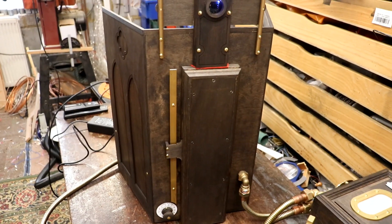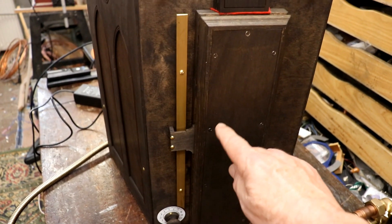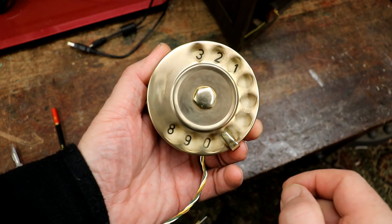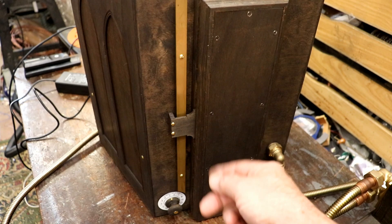But I need a way to tell the Teensy what time for her to say. I was thinking, well, interesting — because there's not much room — I'm going to have to have something on the back of her enclosure. I don't want something else to plug into all this, I want something simple. I was thinking you could have two potentiometers — like an hour and a minute dial — that could tell it. And I thought, why not use one of those old telephone dialing things? I think I've got a couple up in the loft — that would be ideal. It would also allow me to prolong the end of this project by quite a long time, and learn how to actually read the pulses that come out of one of these telephone dial things. Thanks very much for watching — as always, please remember to click like, subscribe, and the bell button. Hope to see you next time.